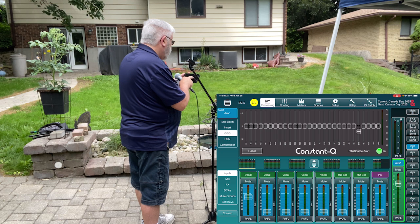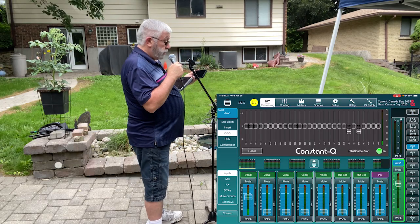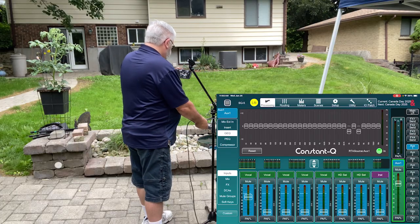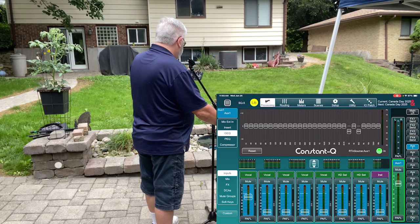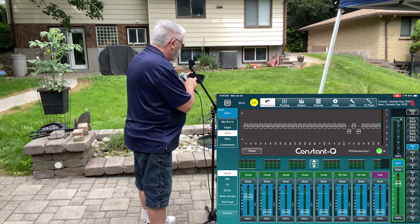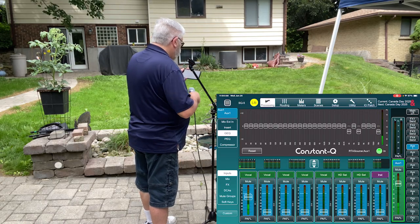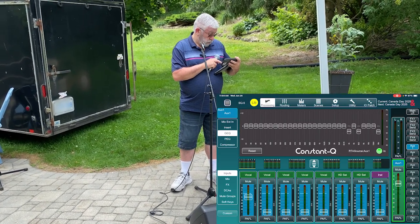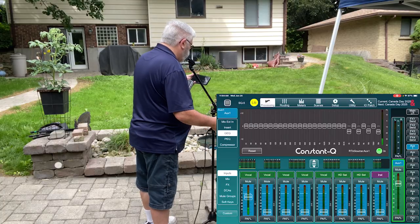And that's about 4K. I'm forcing things beyond what would normally happen, but this is what we want to do — we want to get it as loud as we possibly can without feeding back. I'm watching the RTA as we go along. We're getting up to about 16 dB. That's got a pretty good ring right about there, at about 10,000 Hz. I'll pull that down a little bit and we'll just keep going through this process.